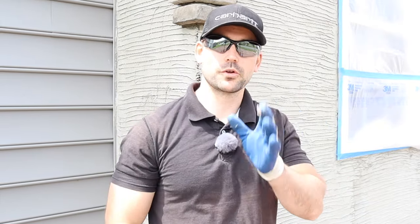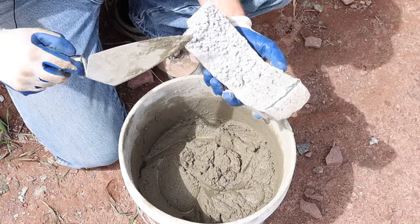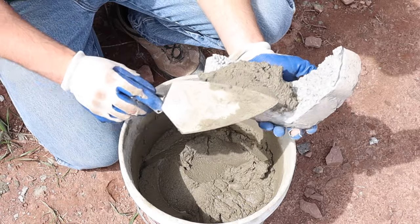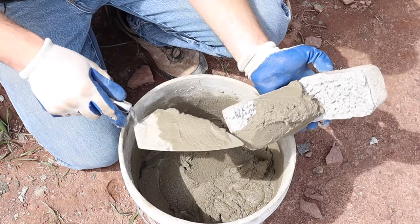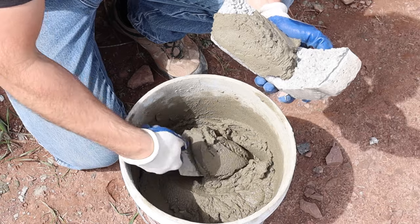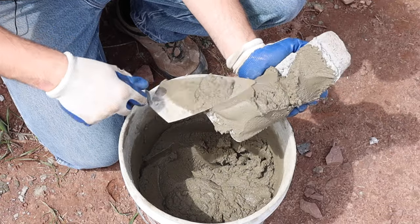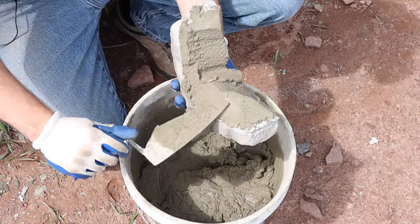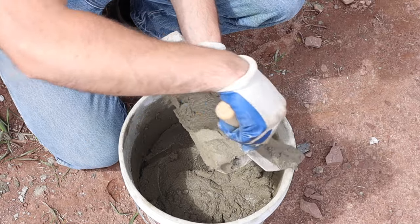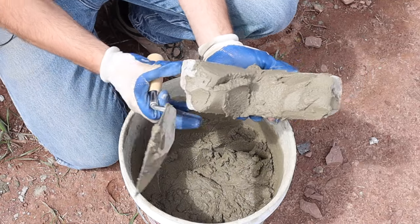Now I'm going to show you how to butter up a corner before you install it. As you can see, on this side it's very rough and textured, which gives a place for the mortar to adhere to easily. All I do is scoop up just enough mortar to give me a half-inch coverage on the backs using a simple trowel — this is a seven-inch trowel used for bricks. I put some on the other side, back butter it like so, smooth it out to about a half inch, and always make sure I cover the whole back side really well.